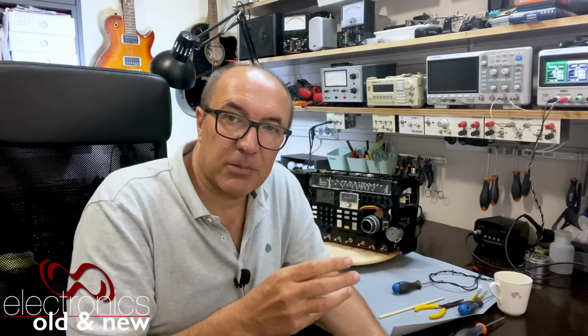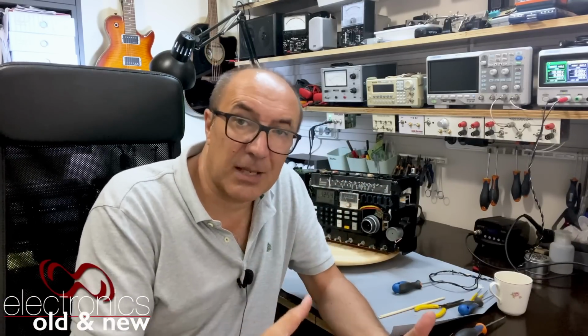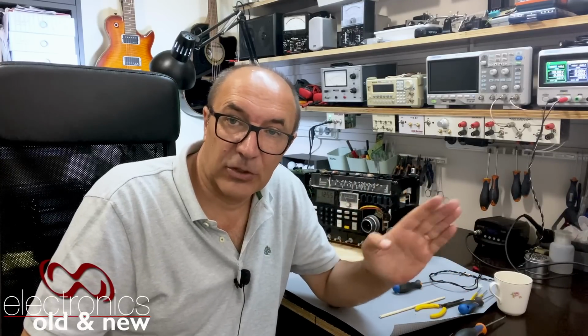So I ordered the chips. I ordered the CD4066, not the MC14066, which is what they had in there. I wasn't sure if it would work, but apparently it's the same chip. So when it arrived, I tried that, and you'll see the result now. But all these things took a hell of a long time. That's why this thing has been on hold for a while.